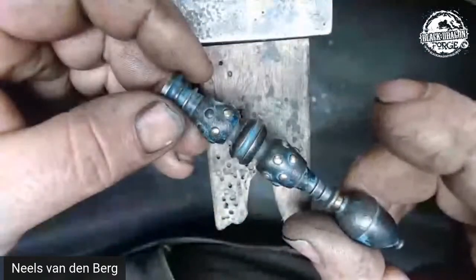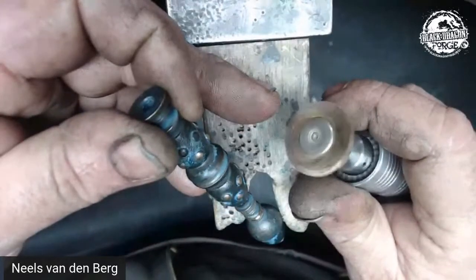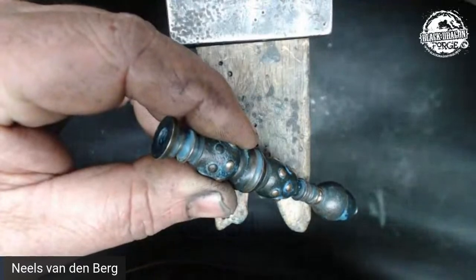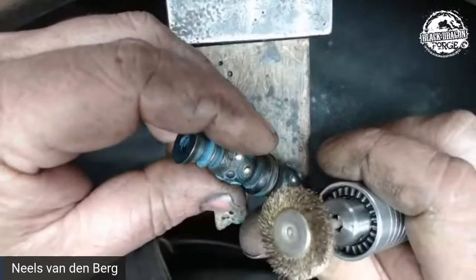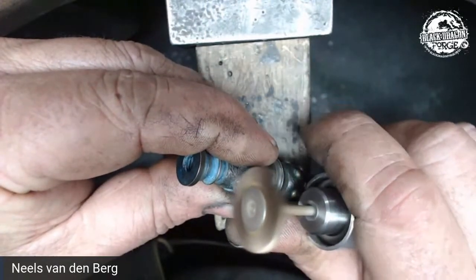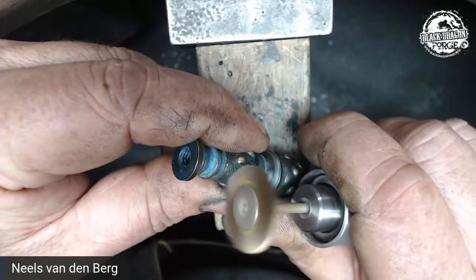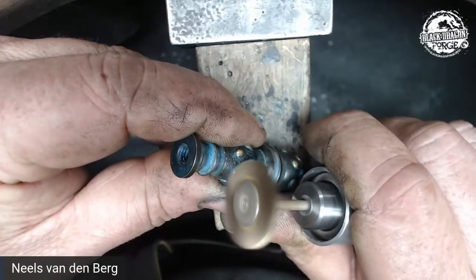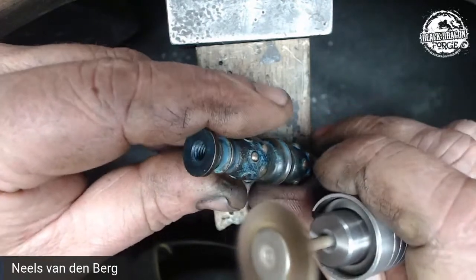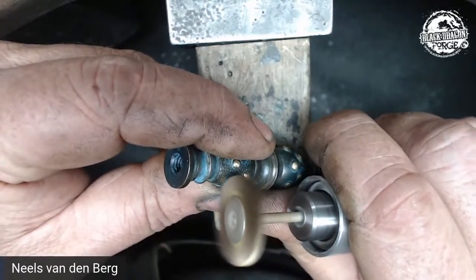Because it really isn't rocket science, but if you don't know, well, then you don't know. So on my flexi shaft I have got a brass bristle brush. Step on the pedal, she slowly turns. I've got my Optivisor, which is a two and a half times magnification, I've got this thing zoomed in fairly closely. We pick one I'm working on at the moment and we start brushing. Be careful not to go too deep, so that I don't take the patina off the base. Only trying to get one side at a time, moving on to the next one. Slowly bringing that one piece up to a nice shine.